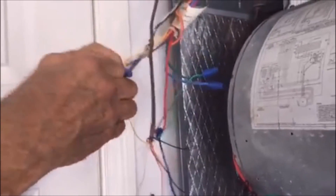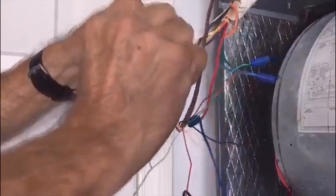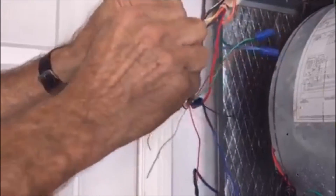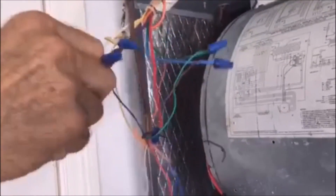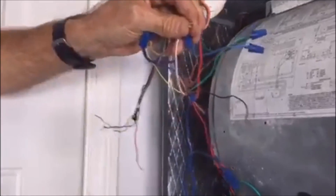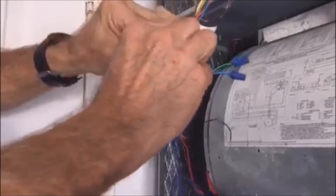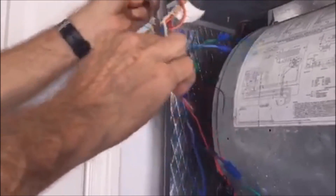The blue wire was my first-stage compressor — I'm at my thermostat and just going to unhook it and tie it back together. Then I've got my white wire, which is the heat wire. I'm just plugging and playing at this stage because I've already made sure I had the right wires for the right job. This customer needed a Wi-Fi thermostat, so we're having to redo this wiring because the original builder did not pull enough wires — that's pretty common throughout the whole United States.